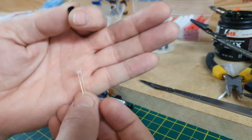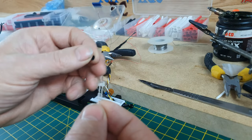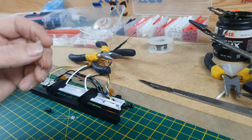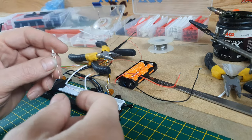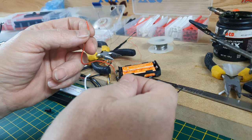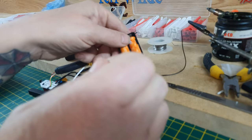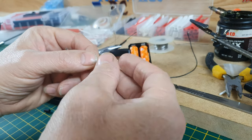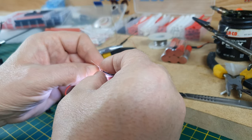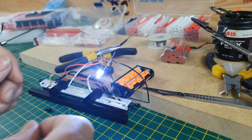For the number plate lights, I'm going to use these little 2mm LEDs. I'll show you how they work — it's a two times 1.5V pack, so that's a 3V pack. The long leg is positive and the short leg is negative. As you can see, that's quite bright all the way through.